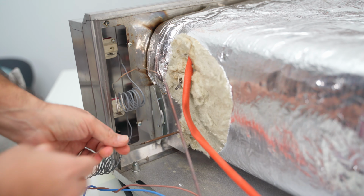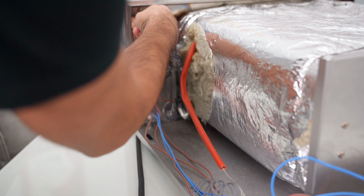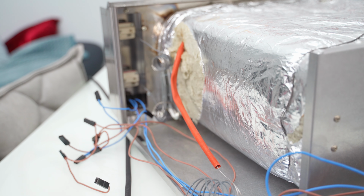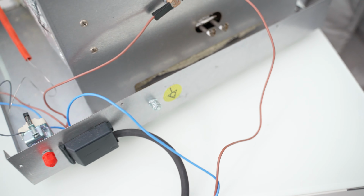Once the 2 old probes have been eliminated, move to the front and start freeing up the front panel by removing all the fastons from the LEDs, the knobs, and trying not to damage the insulating wool with your hands. In the end, we should have removed a total of 8 fastons, and we remove even the fastons of the power switch. However, we should mark the position of these last 2 cables because we will need them later on.